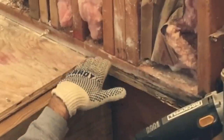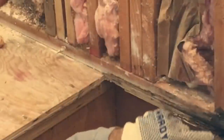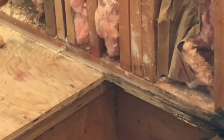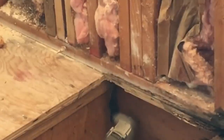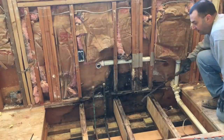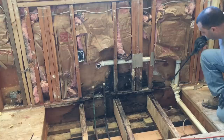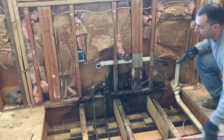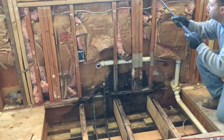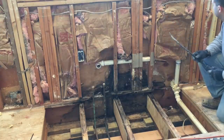There's a little bit of three-quarter inch plywood here that isn't damaged, so I'm going to clean that up. I might as well take the sill plate out too because this whole two-by-four is going to get replaced all the way down to the other end. I'll make a clean cut all the way up through the two-by-four and all the weight will sit on the new joists. Now that everything is shored up, I cut through with my multi-saw and I'm going to replace all these studs — they need a new bottom plate.